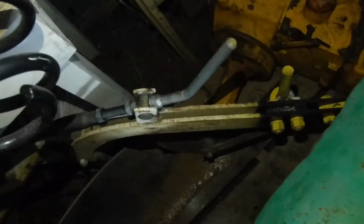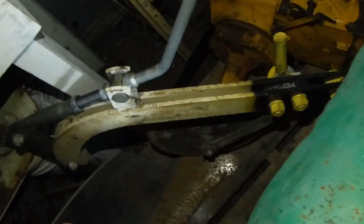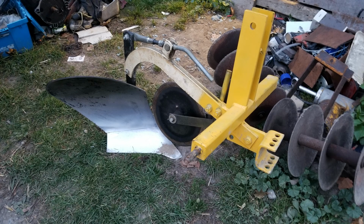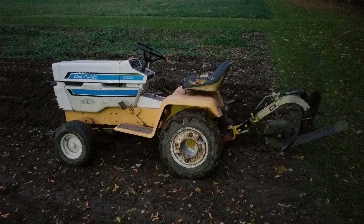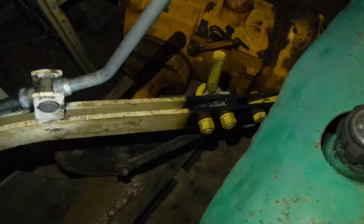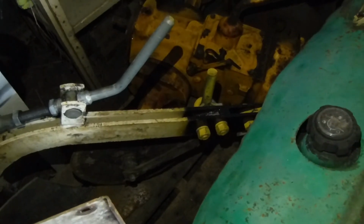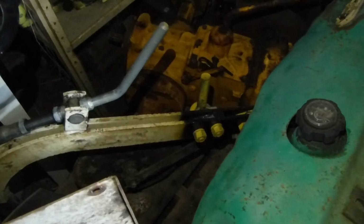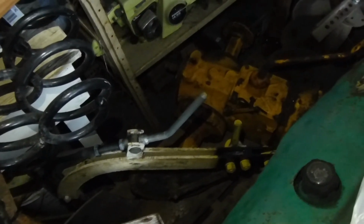On the same trip, I finally acquired a Brinly 10-inch plow, and in the time I got this thing, cleaned it up. I'll see if I can post a picture of how it was when I got it, because the guy I got it from had it modified to a Cat 0 3-point. Nothing I have has got Category 0 3-point on it yet. The Sears 4x4 is going to have it, and the Cub Cadet 1440 articulating tractor is going to have a Cat 0 on the back end of it when I'm done. My 1250 might have Cat 0, but that's still kind of up in the air. I'm thinking anything 12 horse and under can just stick to sleeve hitch. Anything above we'll consider Cat 0.